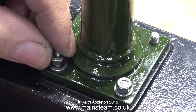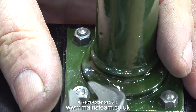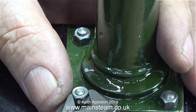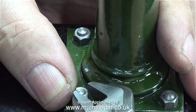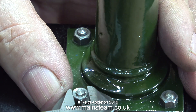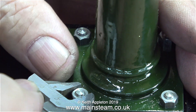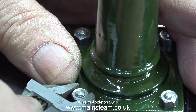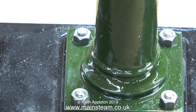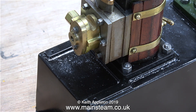It's time to mount the column, and I'm going to use some washers just to demonstrate how horrible they look. It's a matter of personal taste — I do not like using washers for mounting things like columns onto the bed plate. I don't have any 2BA washers smaller than these, and really I just like the effect of a nut directly against the paint. Because I used etching primer, the paint is well stuck and the etching primer is very well bonded to the metal. Yes, the nut is going to mark the paint, but the marks visible in the top left of this image were actually made by the washer. Once these bolts are covered in oil to stop them rusting, everything will look fine. In these highly magnified images every tiny mark and fingerprint shows up, but when I look at the parts without a camera they look fine.